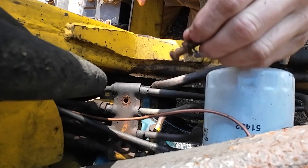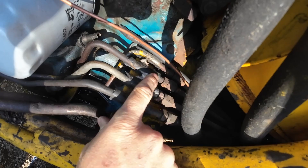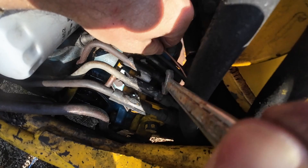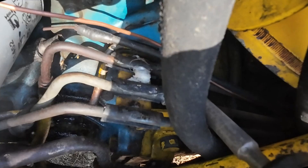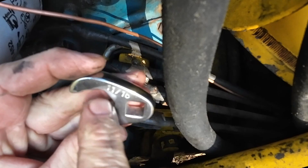Two different length bolts — the longer one goes to the block. This one's got a nut down there we can undo, but this one the hard line is built into the hose and comes up around. I may end up going and getting the hammer drill so we can buzz it. I'm going to get the right wrench. Dave from Sassafras Valley Woodworks sent me these — it's a line wrench that goes on to three-eighths — and I think this is going to save us a whole lot of trouble today.